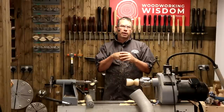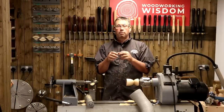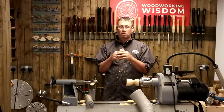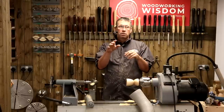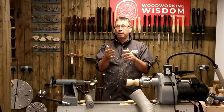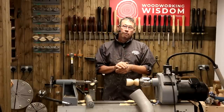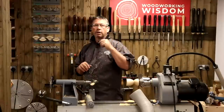But over the years of teaching and things, I find bringing those wings back a lot further means they're less aggressive and less likely to catch. So none of my tools at home have that flat grind at all. Some have a very slight grind on. Bottom feeders, for instance, I tend to put only a very slight grind on. Yeah, so that's me. I mean, roughing gouges are the place for a flat grind, certainly in my opinion anyway.